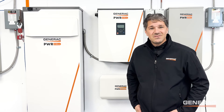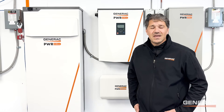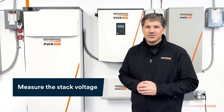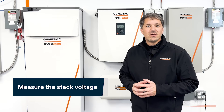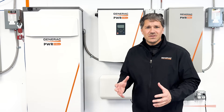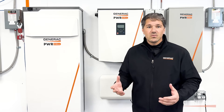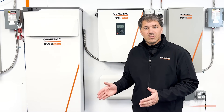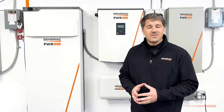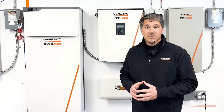If the switch is on and you're still getting battery not ready, check for voltage issues on the stack side of the converter. Stack voltage should measure somewhere in the range of 35 to 52 VDC multiplied by the number of modules installed. Battery modules are connected in series, so the stack voltage is the sum of all battery modules. In other words, if you divide the stack voltage by the number of modules installed, you should get a number in the 35 to 52 VDC range — this is the typical voltage range of a single battery module.